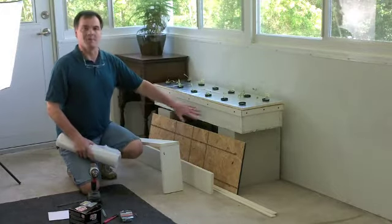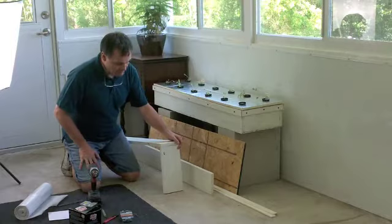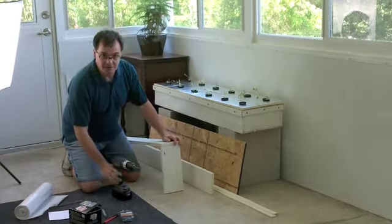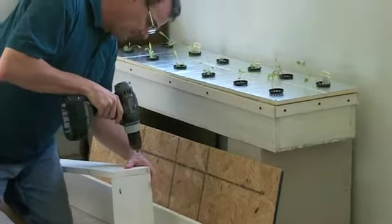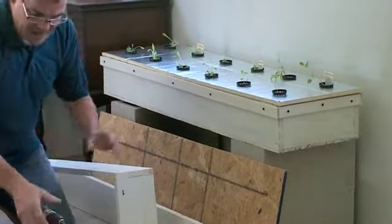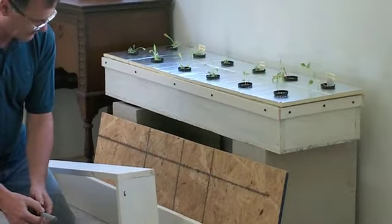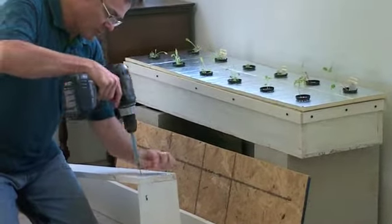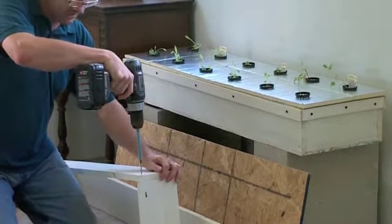With these 4x8 sheets, we're going to be able to build about four of these boxes. Since these are 1x6 boards, one thing I would recommend is that you go ahead and make sure you do a pilot hole. Make sure, if you're drilling or sawing, you put your safety glasses on. Watch your hands — either use gloves or keep them out of the way. The reason we're going to do pilot holes is with it being 1x6s and towards the end, if we don't have pilot holes in there, there's a good chance that you can split the boards, and we don't want that to happen. We're using an inch and a half going in to hold our boards together, but we switch to a one inch screw for our lath so that we don't have points that go through and puncture our plastic on the inside.